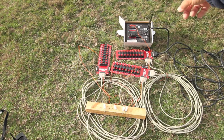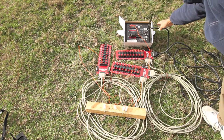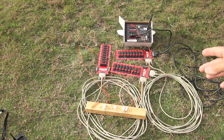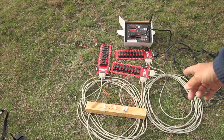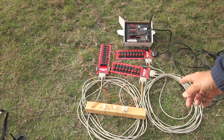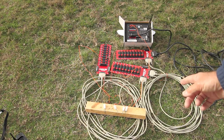The first slat is connected to the module with the heavy cable that Scott Smith sells at Cobra Firing Systems. That black cable there is a 22-gauge cable, but the final slats are connected all in parallel using this cheap 28-gauge DB25 cable I got from Amazon. It's very cheap, it's very lightweight, and I was curious to see if it could fire given the fact that it's 28-gauge.